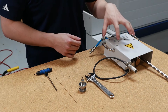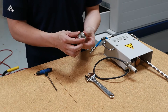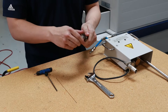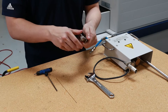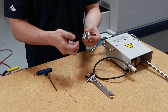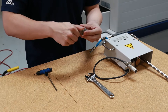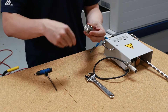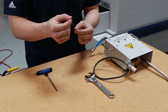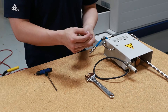Before we can mount the SHM, we have to actually load the electrode into the chuck or into the collet. These are actually two parts — one part is where the electrode goes in, and this part squeezes that together and holds onto the electrode. The electrode I'm using today is a 300 millimeter length, 1 millimeter diameter, and this is standard on all SHM units.